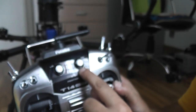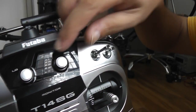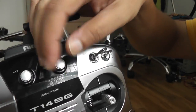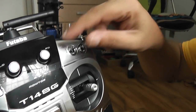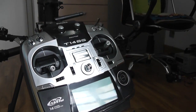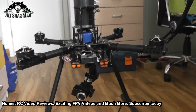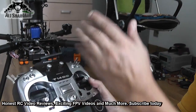The most important control is the RD knob — remember, clockwise all the way right is the safe position for the parachute. If you put it all the way to the left counterclockwise, your parachute will open. Make sure before flight this is all the way right, otherwise as soon as you power on the servo will release the lock and your parachute will open. During flight, if you want to open the parachute, the quadcopter should be flying at at least 50 meters altitude — but don't open it except in an emergency.